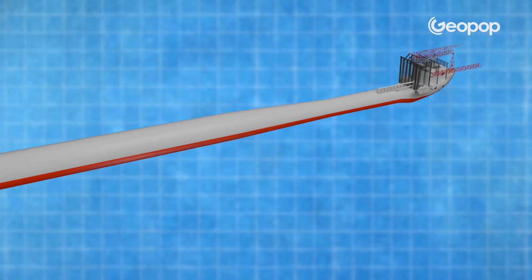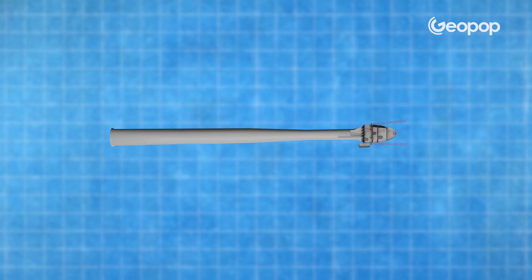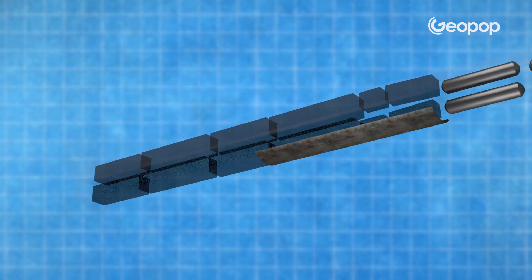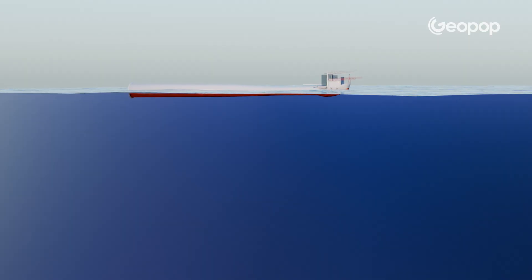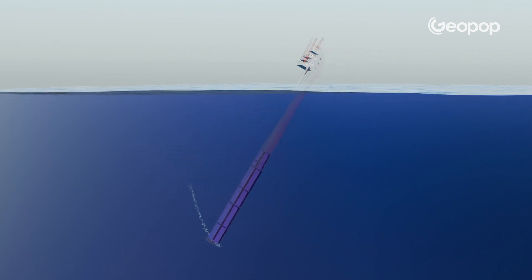To put it simply, this cylinder was divided into two sections — one narrower and one wider. In the widest part were the ballasts: one consisting of a concrete block, and the others of tanks filled with air that contributed to the buoyancy of the structure in a horizontal position. At the time of the maneuver, air was released to let water in, increasing the weight of the structure at the rear of the platform.